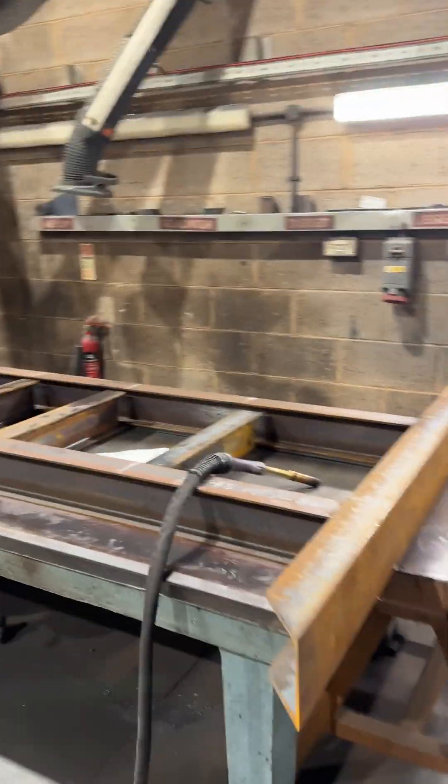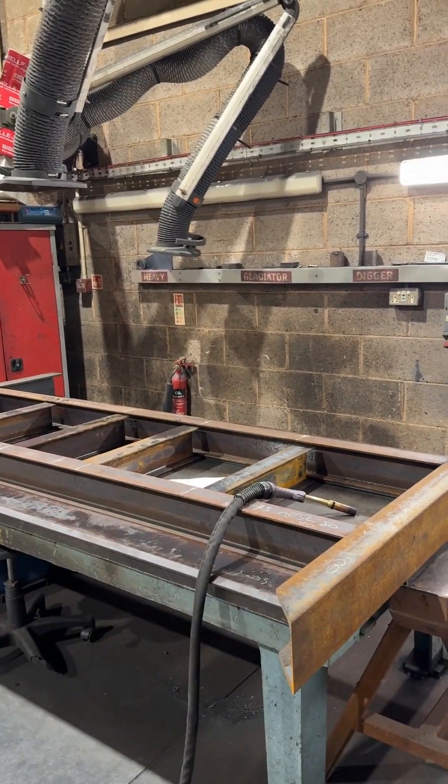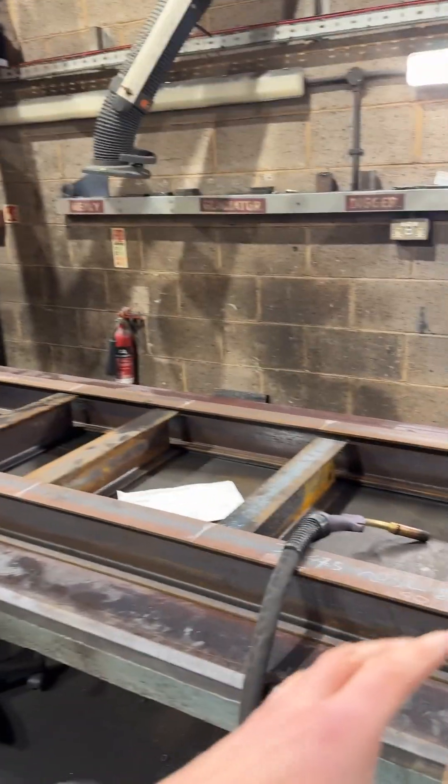So if you are looking for a grading beam, just have a quick look at that, because it's not just the width of the beam but also the depth of the beam and how it's built, and also the rigidity — how many cross braces you've got in between and what they're built out of.